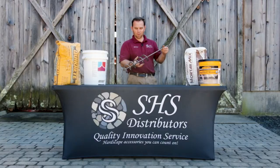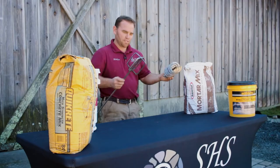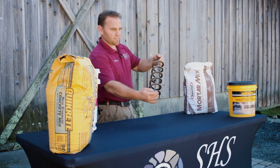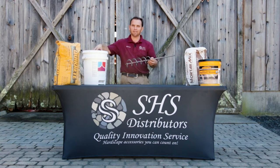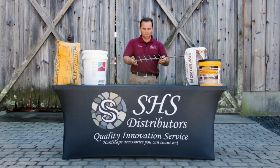Let me tell you about this Superior Auger Mixer and what makes it better or superior than some of the other augers out there. For example, I have a paddle mixer here — it takes a lot of power to run paddle mixers. The Superior Auger Mixer mixes from the bottom to top, and that mixing action takes very little power to run. I can run this with my 18-volt drill and mix all my products in a five-gallon bucket, as opposed to a wheelbarrow and a hoe or shovel. It makes it very easy and also very easy to clean up.